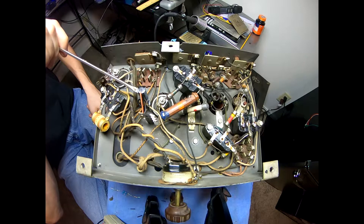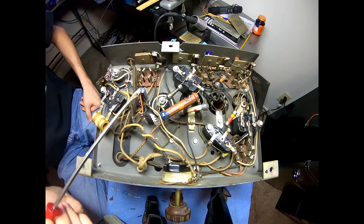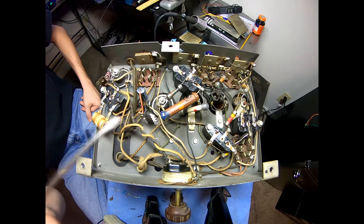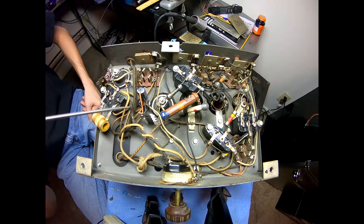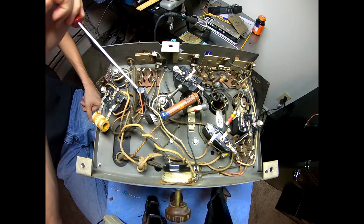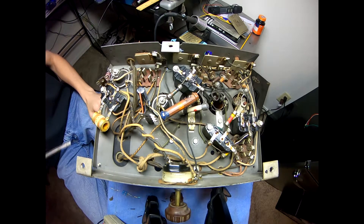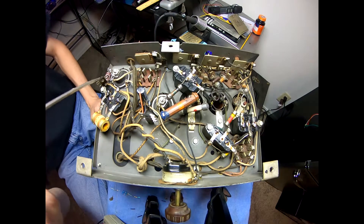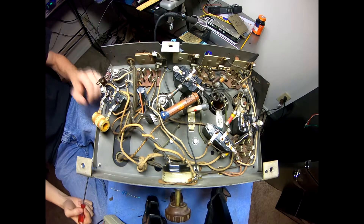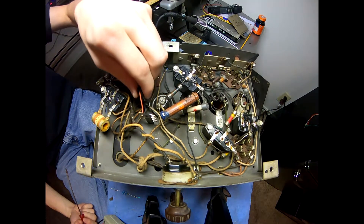The one thing I have not done yet on this capacitor is hook up the components to the positive lead. I have added a wire splice from the negative on the new cap to the negative post on the old one and left all that wiring intact — I didn't want to move all that over since some of the wires are a bit too short. However, on this guy over here the positive wires were more than long enough to reach the new terminals.